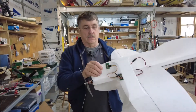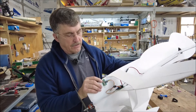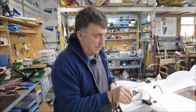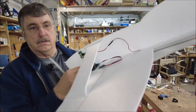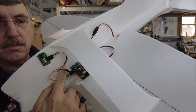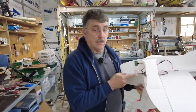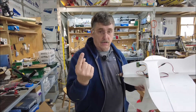This is a breadboard, so there are a lot of pieces on it, and it's based on some off-the-shelf components. I have a start switch and two indicator lights. One light is a warning light — it tells you that the motor is going to start or stop. The other tells you that it's running. On my board back here I have three adjustment pots: one is for time, one is for gain, and the other is for power. After building and using it, I've decided I need four pots so I can adjust both the attitude gain and the control gain independently.